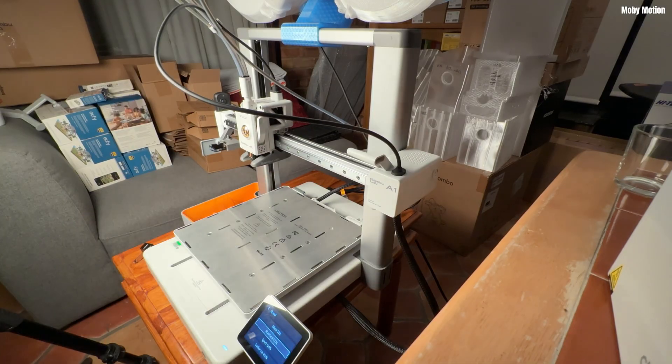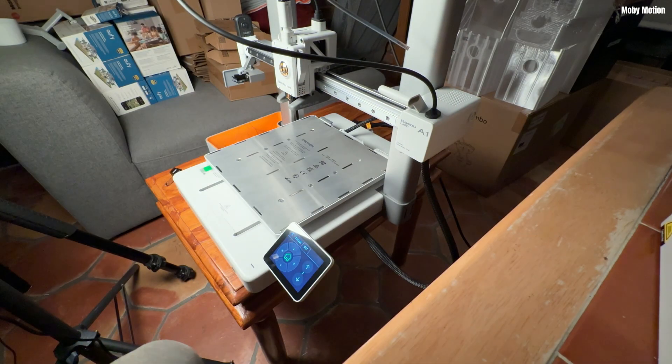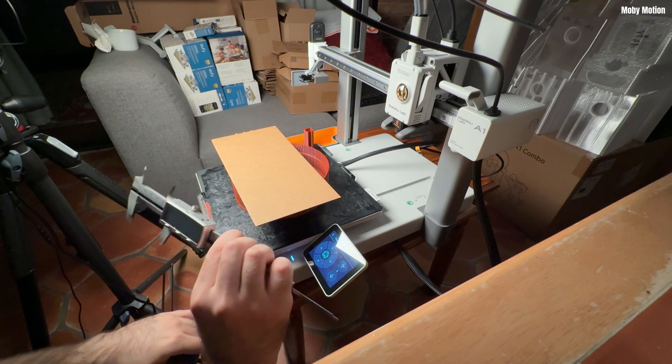This sounds simple conceptually but the difficulty is in actually editing the g-code. Even though it's harder than the other solutions, I don't mind something hard when you can learn something interesting and pick up a tool for your arsenal. I had some issues initially — you have to home the printer, but you can't home while there's a print on the bed because it might crash into it. So I removed the plate with the carbon fiber part on it as carefully as I could without popping the part off. Luckily I had a second build plate which was textured. I put that on, homed using the empty plate, then put back the build plate with the part on it and made sure the bed was heated as per Stefan's recommendation. I averaged multiple measurements to reduce measurement error and concluded that the next layer I needed to print was layer 259.